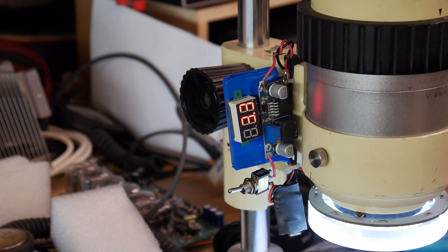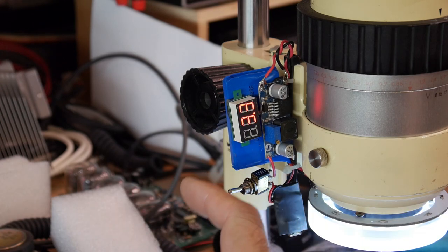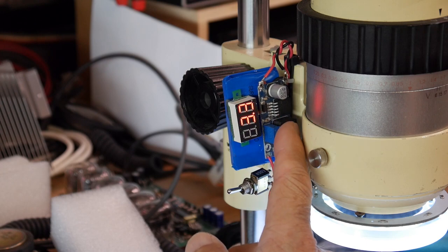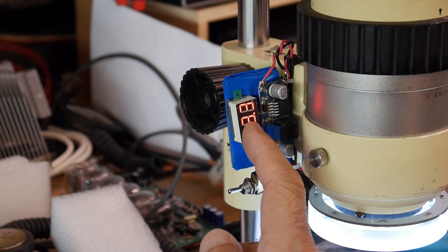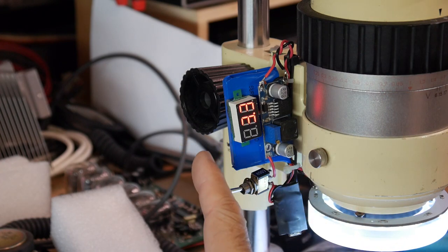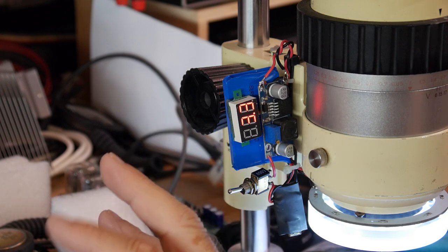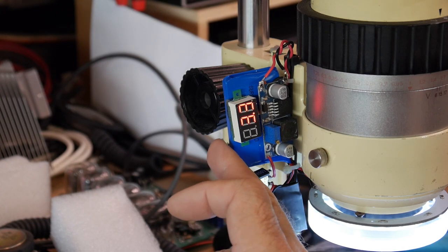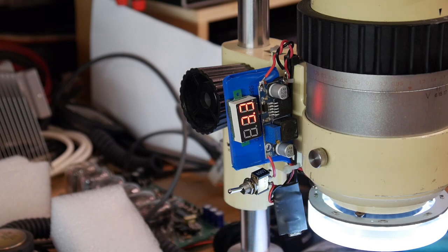You'll need some way to power the ring light. For a while I just hooked up one of my lab power supplies. Then I decided to go ahead and make it battery powered. So there's a lithium battery here, a DC to DC converter to 12 volts, a LED monitor for the battery voltage, and the battery charge circuit down here. I'll show you the components I used to build this. I stole this battery out of something I had — it's like a 600 milliamp hour, 3.7 volt lithium.